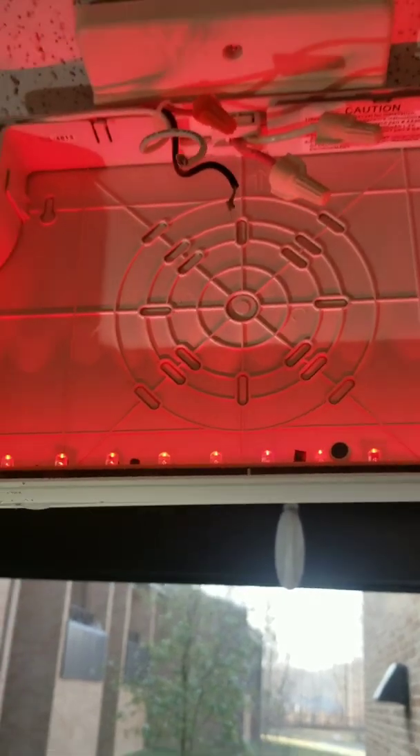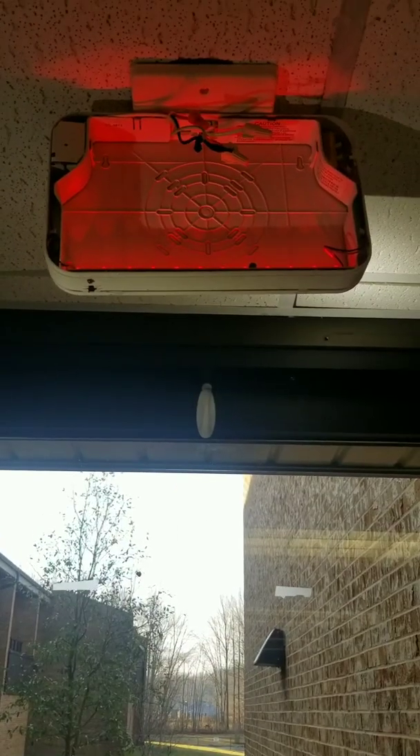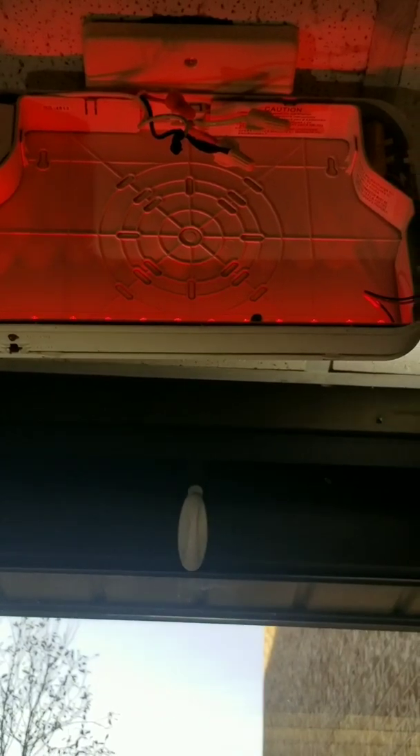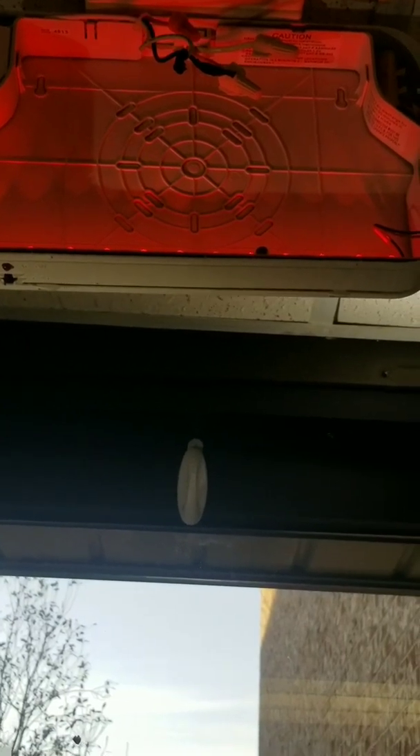What we're going to do is put electrical tape around the white and black wires. I should note: if you don't feel comfortable working with live electricity, the first step would be to shut the power off. But now that I have everything taped off and capped, I'm going to shut the power off to pull the wires through.